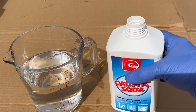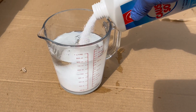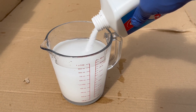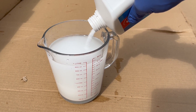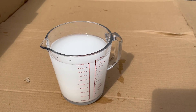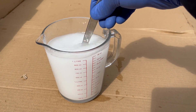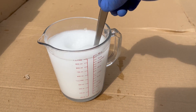So we've got the caustic soda and a jug containing the water. Remember: add the caustic soda to the water, not the other way around. We're going with a 70/30 percent mix — 700 ml of water, bringing the caustic soda up to one litre. Straight away you'll feel it getting warm, so give it a good stir to make sure the solution is well mixed and not sitting at the bottom. You will feel the solution reacting with the water and getting hot.